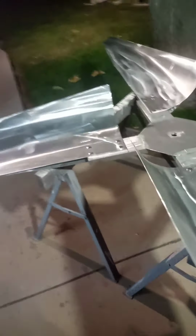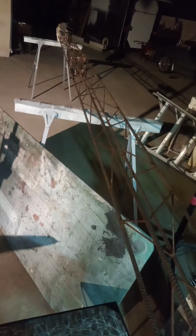Oh yeah, and this is another tower. This is a 20-foot tower I will have going up at some point. This is a more permanent one. Actually, I built it out of number 4 1/2-inch rebar, and then crossed it up with a 1/4-inch rod, you know, to brace it, just like they do in telephone towers or something. And it came out real well. It's real sturdy, real stiff, and actually in 2 pieces, 2 10-foot pieces there. So it'll be a nice tower, real sturdy, hold a lot of weight, because my first wind turbine was actually about 140 or 150 pounds, heavy rotors.